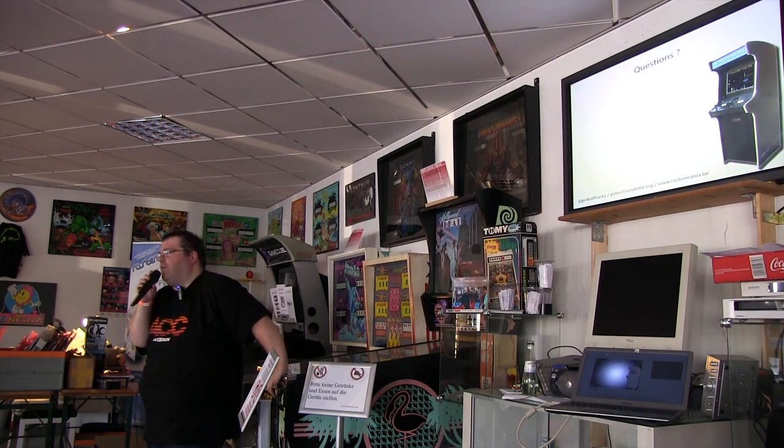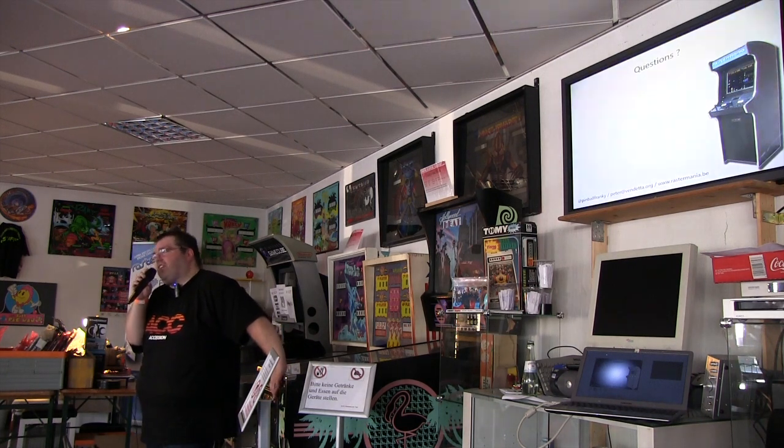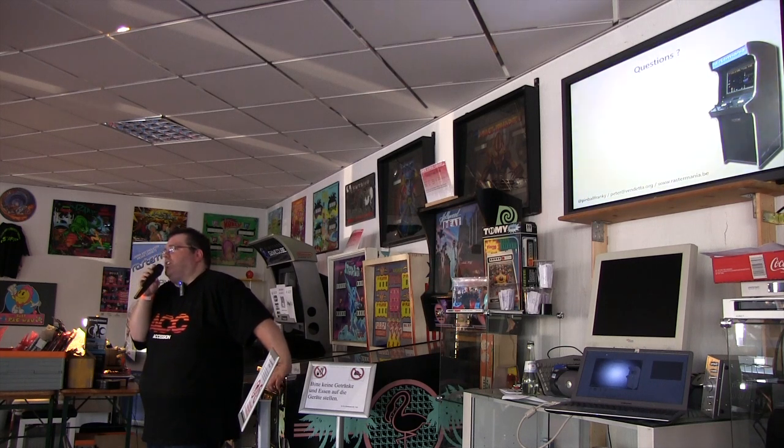For instance, many older TVs will have a high resistance, many modern ones have a lower one. Unless it's a really big screen, then you again have a higher one. So you would need to take measurements of your old tube, of all the pins, to see what's what, which signal is your red, your green, your blue, what's your ground, which are your heaters, which is your high voltage, and then look at the resistance of your yoke coil, and then maybe it can work.